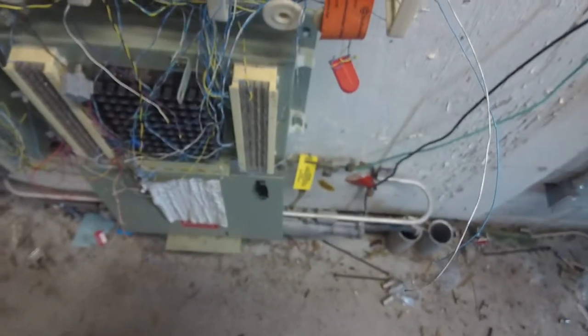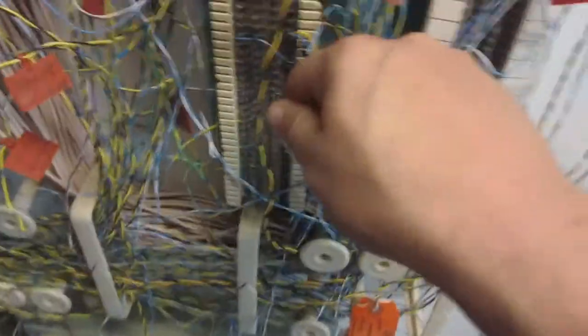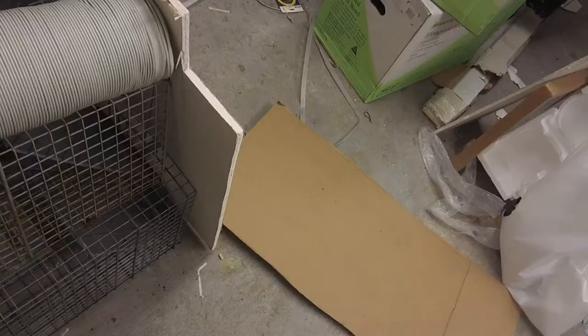So I'm gonna leave this wrapped up and just sticking out, so when I come back, I'll unwrap it and hopefully it'll just go right there and we'll be done. Alright, let's go get the toner, and then we'll go to the room and put the toner on the room to find where the room is, and then hook this wire to wherever the room is. Apartment 223. I might want to look at these tags. Well, nah. No such luck. Safer to tone it out anyway, so we'll be back again.